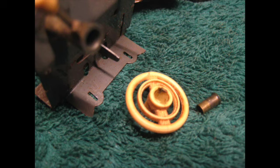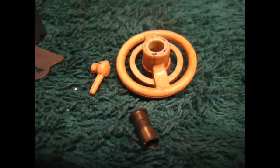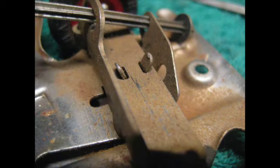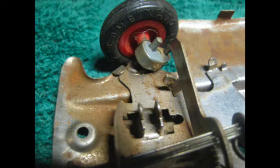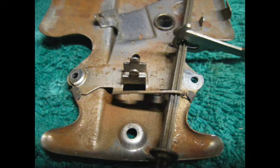Now we've pulled the steering wheel off and there's a little cup inside there — you've got to be careful not to lose that part. Here's the steering wheel with the cup inside of it, and we've got the speedometer off too — we're going to clean those in a little while. Here we've taken off the horn motor and we're looking at the steering mechanism. To do that we need to fold back those two little tabs in the middle, make them come straight up, and that'll pull out that very important part of the steering mechanism. There it is taken apart, and now we can take the wheels off with their knuckles.